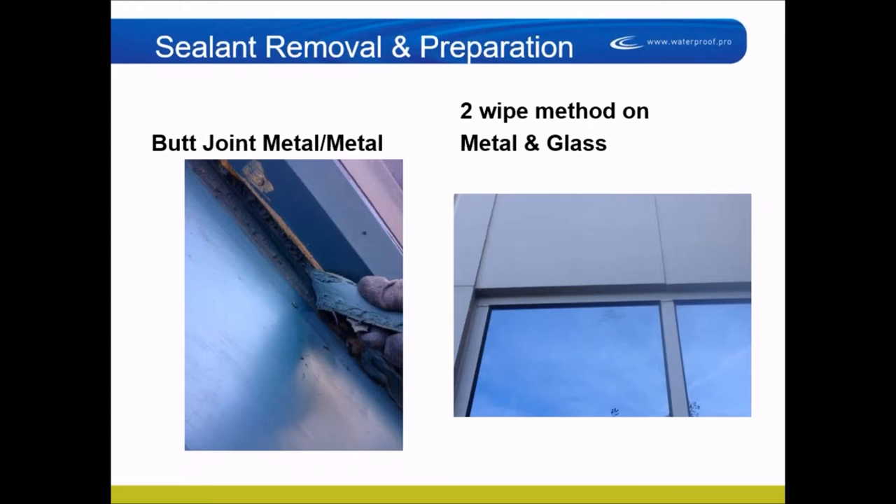On the right-hand side, we have a couple joints where the panels look smooth like metal but are actually cast stone. Those were ground to remove the silicone oils, and then we ground the sealant between the metal window frame and the cast stone after cutting out, then solvent-wiped. The metal-to-metal connections were done as a bridge joint. You can see at the heads of the windows where the mullions meet the top rail — that little bump-out is actually joint sealant applied with a special tool.